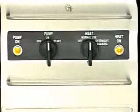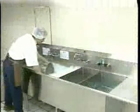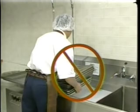To begin washing, turn the heat switch to normal. Be sure to pre-scrape all items. Scrape loose food soil into a trash receptacle or into the optional built-in scrapper. Place large items directly into the wash sink. Place smaller items in the utensil basket and place the utensil basket into the wash sink. Do not nest or stack pans together. Nesting and stacking will inhibit the wash action.